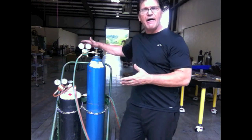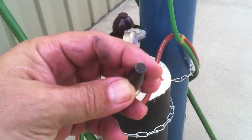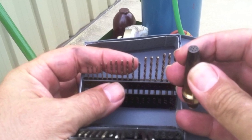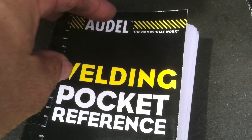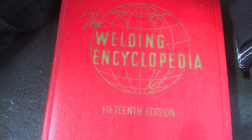One way, if you don't have the manufacturer's tip charts, is to determine the center hole size using a drill index and then consult a chart. That center hole size is really the main thing when determining how much oxygen pressure you need. Somebody emailed me about a book published by Audel called the Welding Pocket Reference. You can get it on Amazon. I ordered it to see if it was any good, and I can recommend it — it's a good book with just a few minor technical errors.